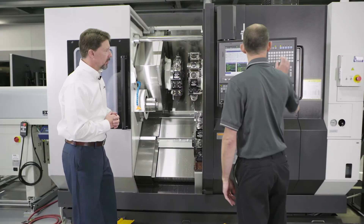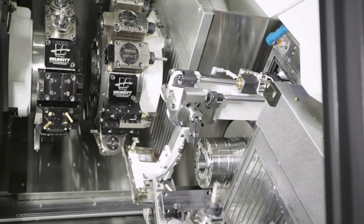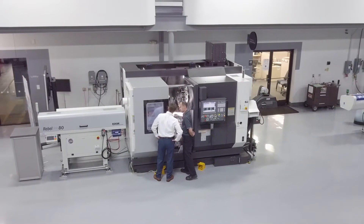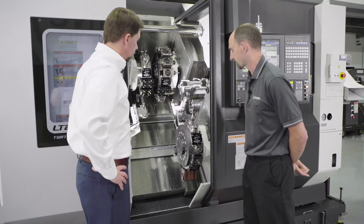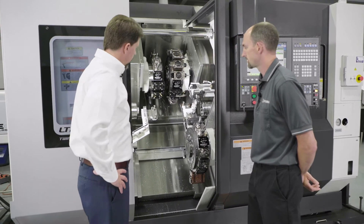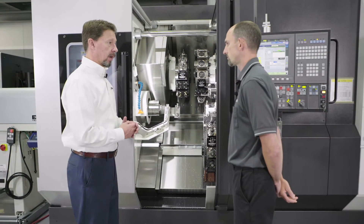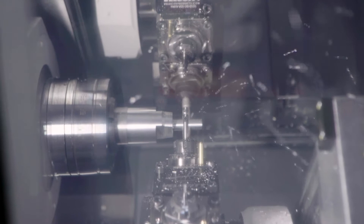Why don't you go ahead and lower down the automatic tool setters? With three turrets with 16 stations and the ability to have multiple redundant tools, there's a lot of cutting edges that go into a machine like this. We have two automatic touch setters in here, one on each spindle. They both have a few touch probes so you're able to touch off tools on either the upper turrets or the lower turret. It's going to make setup faster and more accurate. You can also use it basically like a tool break detection in a production environment for lights-out operation — it's fully programmable so we can check for broken tools in process and help reduce scrap.